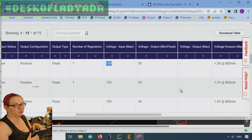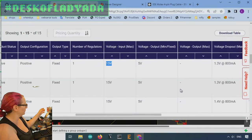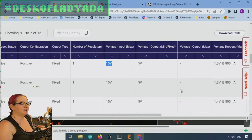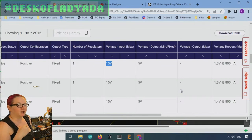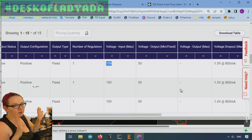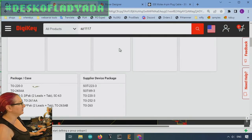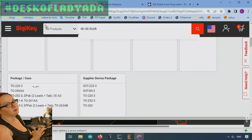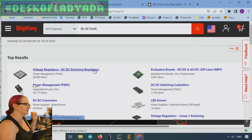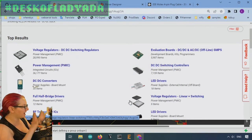So let's look at DC-DC buck converters. There are switching controllers, switching regulators, and switching converters — a lot of things that sound very similar. These converter modules are fine to use if you don't want to deal with inductors and such. But I want to keep costs low, so let's look at a regulator that gives a regulated output. There are about 30,000 options — filtering to active, normally stocked, excluding marketplace gets us down to about 7,000.